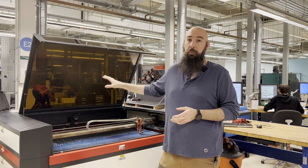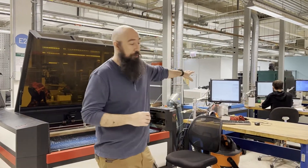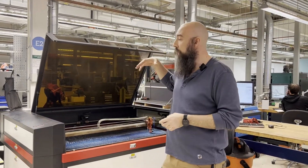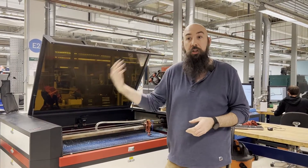There's a little bit more to that, but in general this is one of the first tools that we point people towards when they're learning, just for prototyping, because everything is so rapid and quick and materials are fairly cheap in general. We have a couple of other laser cutters in the building — a couple of Universal lasers — but this is our largest size bed. The upgrade we've done is a little bit of positive air pressure around the mirror system so that less dust and particulate will collect and degrade the lenses.